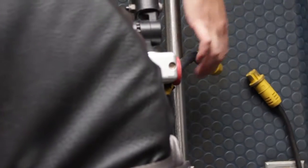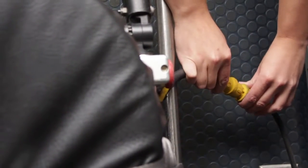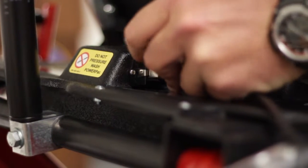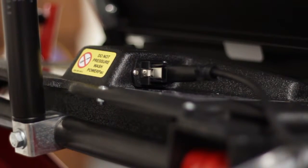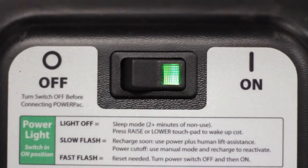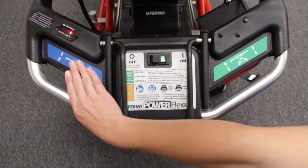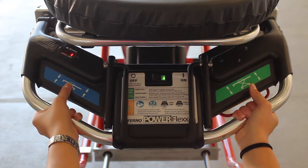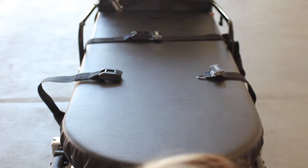If you're using the ICS or BCS, you'll need to connect the cot-side cable to the 24-volt DC charging port on top of the power pack. Turn the power switch on and press the touchpad once to activate the system. Press it a second time to move the cot up or down to verify that the system is functioning properly.